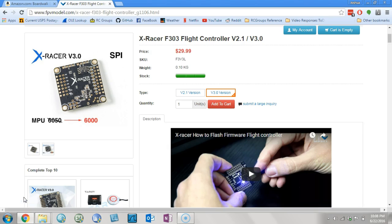My initial complaint with this board was that it didn't have a VBAT pin, and then they released V2.0 which had a VBAT pin — and that's good. But it still had those ugly pads for the battery and other sensors instead of through holes. Then V2.1 came out with the through holes, and it was almost perfect. But the one complaint about V2.1 would be that it only ran up to 4kHz, because it had the MPU6050 chip on it, which uses I2C and can only run up to 4kHz.